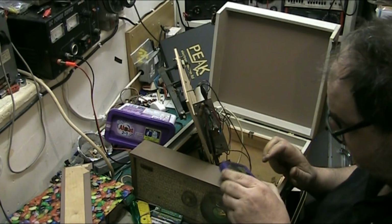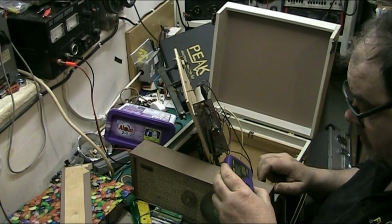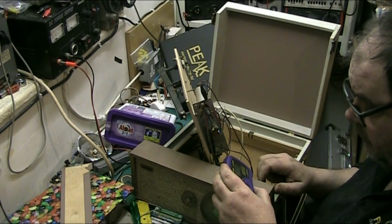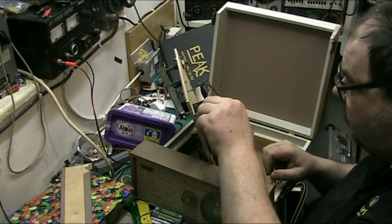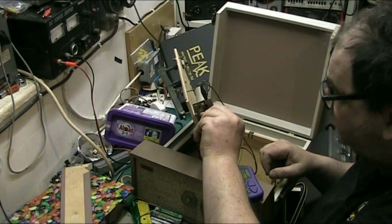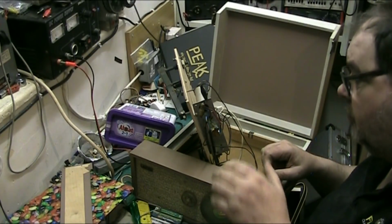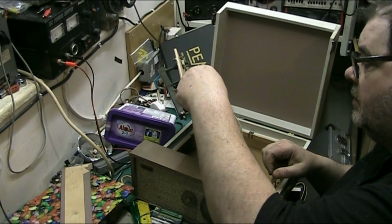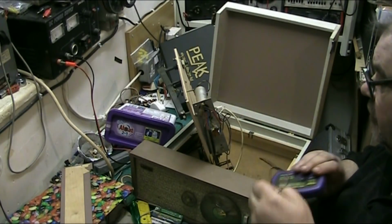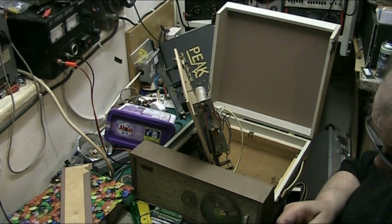Connect that to the capacitor, see what we are. We should be 50 microfarad. We're 61. And 0.53 ohms. So let's check the next one. They're a bit off, but I think they suffice. 56.64 ohms. Yeah, that'll do. 300 volts working. It's not going to see anywhere near that. Oh, hang on. There we go.